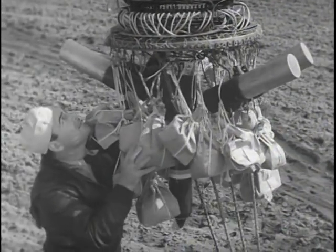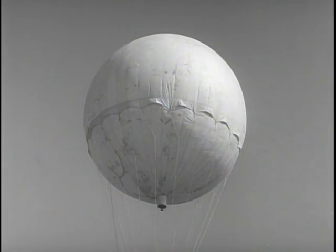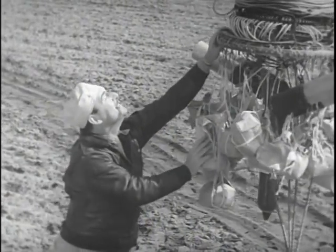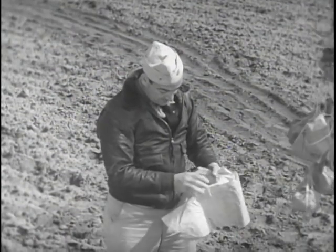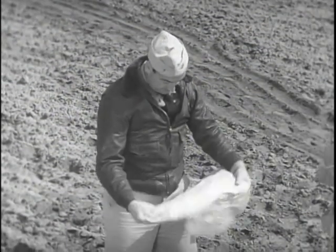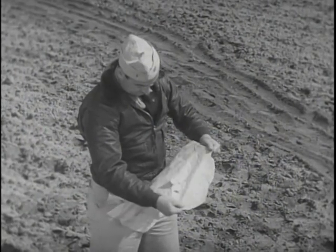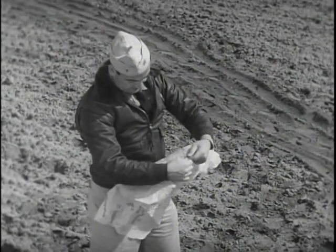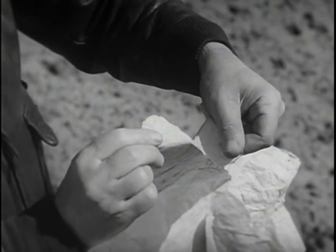The material of the bag is five-ply rice paper, about eight ten-thousandths of an inch thick. The paper strength is 69 pounds per linear inch when dry, and about 37 pounds per linear inch when wet. It has one-tenth the permeability of American rubberized balloon fabric. When the bag is inflated, the paper has a load of only seven pounds per linear inch, or one-fifth the strength of the paper.